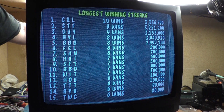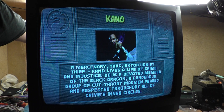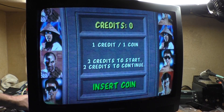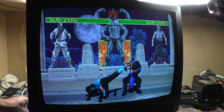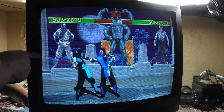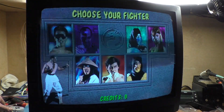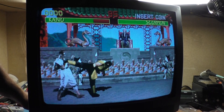Let's turn green up a bit and red up slightly. Vertical size down to about there. Width is perfect. H position — we've got raster edge to raster edge on both sides. Look at that, gorgeous. These look much better in person than through the camera. H position needs to move over a touch and right there — outstanding.